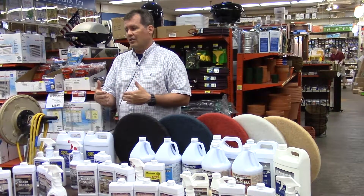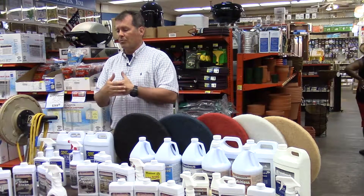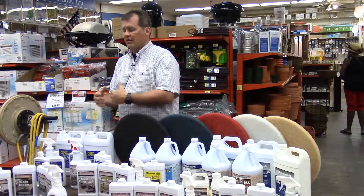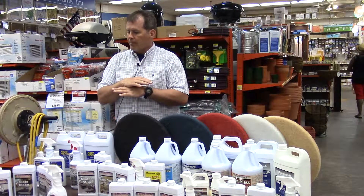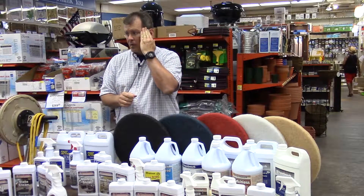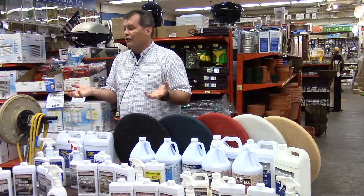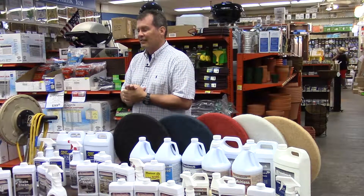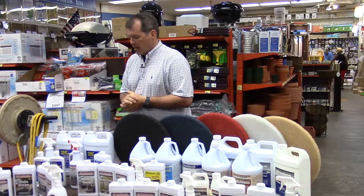Professional flooring guys can come in and do a patch repair, and they'll do their best to match it — but usually the matching isn't 100%. It's always best done when you're planning on resurfacing the entire floor: patch things up, sand the entire floor, pick your stain color, then pick whatever water-based polyurethane protection you want on it. Using PolyProtect will definitely make it look fresher, but I'm not going to say a deep black stain is just going to disappear.